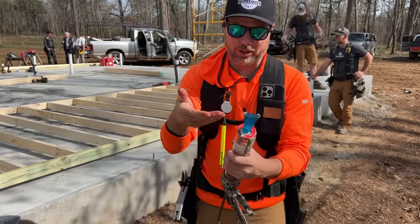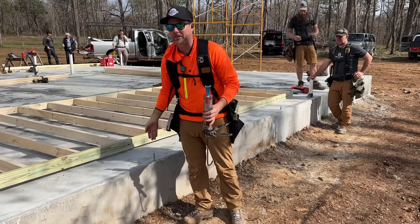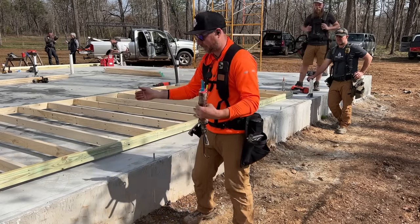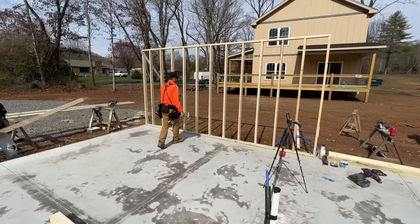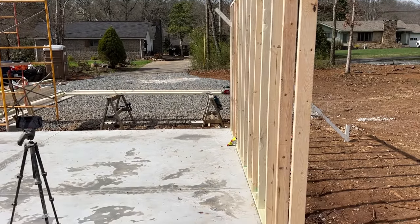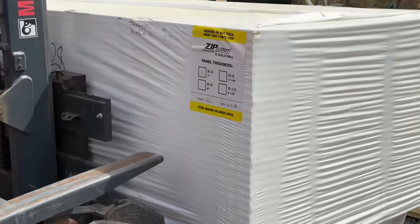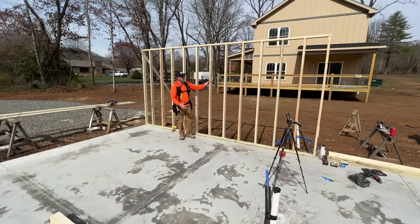The Cobra nozzle is an invention by the guy who made Lexell — it gives you a nice wide bead. We're doing two beads and it squishes out to give a solid gasket, even squeezing out the sides. We're using two-by-four studs 16 inches on center, which is what code requires for a wall like this with another floor and roof load. We're using zip-R sheathing, which has a half-inch layer of rigid foam, and that's really going to make this wall perform almost as well as a two-by-six wall once we add conventional insulation.